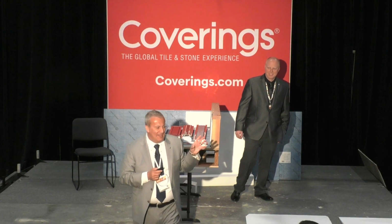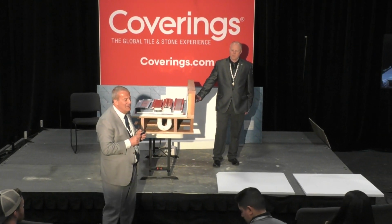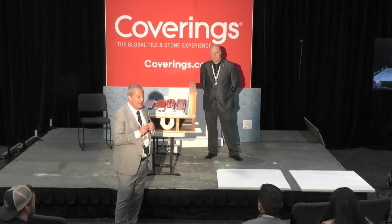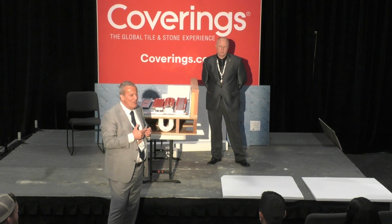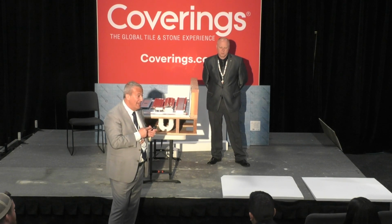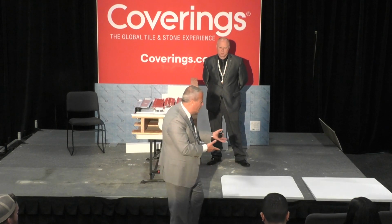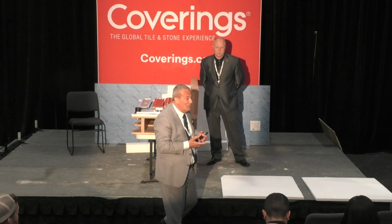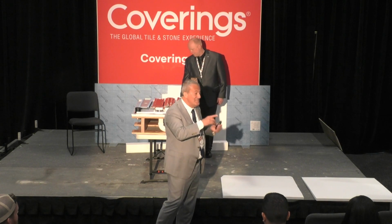I don't know if the difference is evident between using a pan and not using a pan. Even from a distribution point of view, having a pan that's preset in dimension creates a lot of problems, especially in a time like this when stuff is hard to get, because you end up with your particular shower size being back ordered. So you either modify your design or you modify your pan. In our case, there is no standard. Two wedges give you 6 feet, but if you need 9 feet, you take 3 wedges. There is nothing to it. Even from an inventory point of view, from a distributor, it's just wedges and panels. You can do any size.